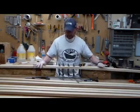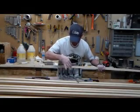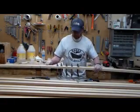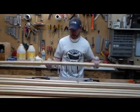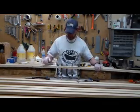After it's glued, I like to set it like this so there's no chance that the epoxy, because you're going to have some squeeze out. You can probably see here there's epoxy oozing out. Certainly on that side you can see it. Anyways, if you set it on edge, I always wonder, is all the epoxy going to drip out? So I keep it like this, so you're going to have a natural squeeze out, but the majority of the epoxy is going to stay inside.